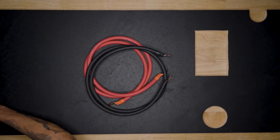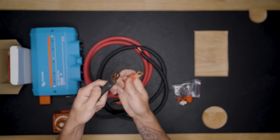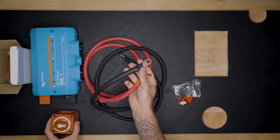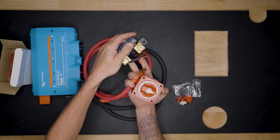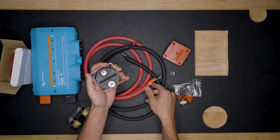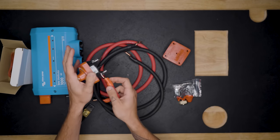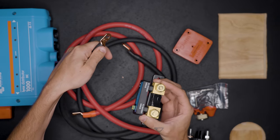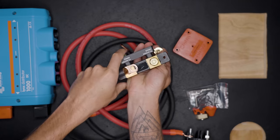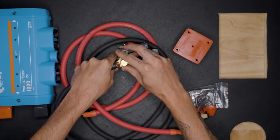Now that our wires are made we can start connecting the wires to the other hardware on the Lynx distributor. On each of these wires there is a 3/8-inch hole on one side of the lugs and a 5/16 on the other side. The end with the 3/8-inch lugs is going to the switch on the positive wire and the smart shunt on the negative wire. Take the cover off the back, undo the nut off the stud, put the lug on the back of the switch, replace the nut and leave it finger-tight for now. The other 3/8-inch lug goes to the shunt - these wires are going to the batteries, so we connect this wire to the battery minus side, put the lug directly on the shunt with the washer, lock washer and bolt, and finger-tighten for now.